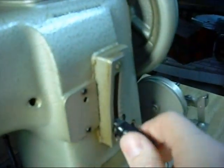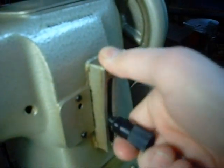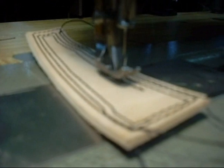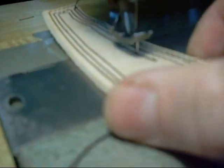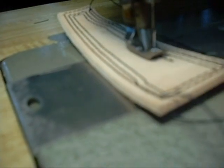I can adjust this lever up and down by cranking the knob here to adjust the overall stitch length. We've also got a knee lift here. So as I'm sewing, I can rock this lever here with my knee, and that causes the presser feet to go up and down. So if I want to raise the feet and then pivot, I can do that while the needle is down in the material.